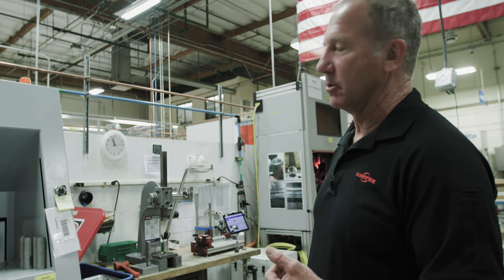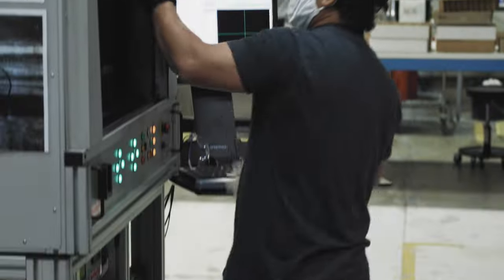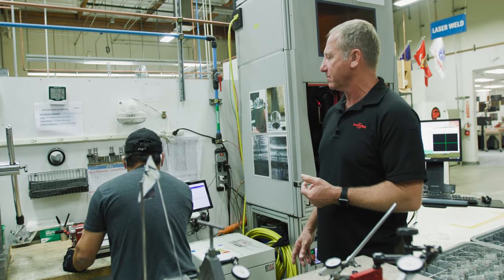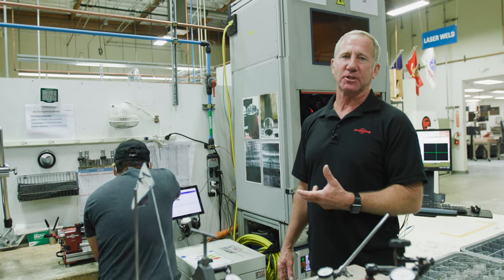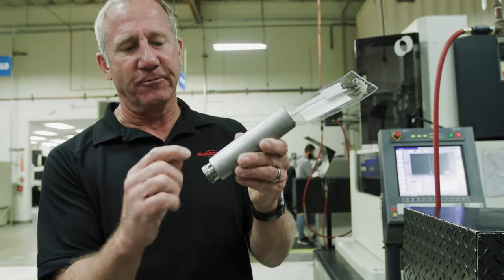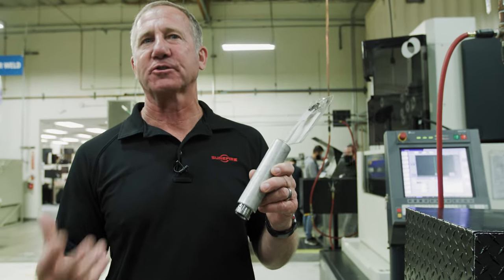Then we come out here to the tube welding process. The core has been laser welded. Now he's going to take the inner assembly, which has been straightness checked, press the tube onto the inner assembly of the suppressor, and then move on to laser welding. The outer tube is getting laser welded on at the front and the rear of the tube. He's going to recheck straightness, all focused on the bore of the suppressor, mounted the same way it is when it goes on the weapon. Even after these two welds, there's no heat discoloration because the lasers put heat only where it's needed.